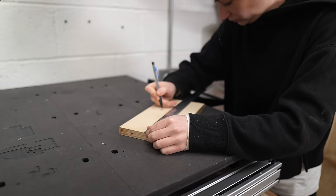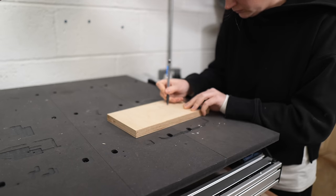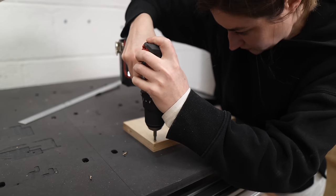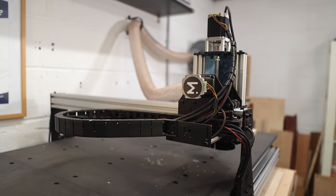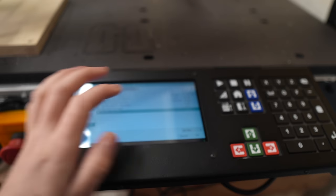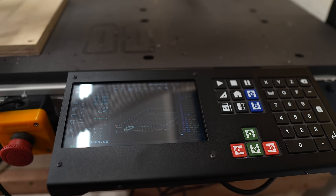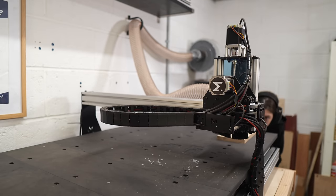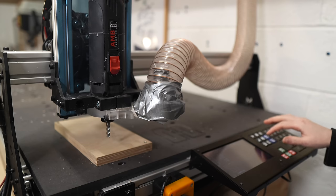Because I'm learning I'm going to use plywood, but I will eventually cut these jigs in acrylic just FYI. That is of course because acrylic is see-through so you can map and align the centre lines on the jig and the workpiece much more easily. Now it's time to load the g-code onto the Planet CNC. It's always quite nerve-wracking putting a new g-code in when you're a beginner because you might have done something wrong with either the computer-aided design or the computer-aided manufacturing — and there are two parts that can go wrong.